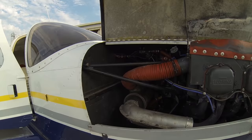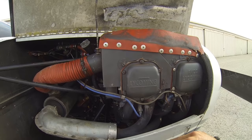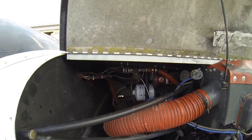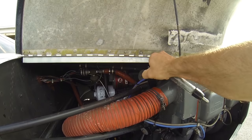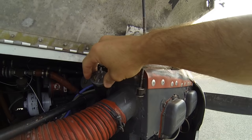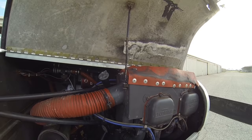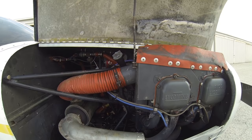As we work our way up to our nose here, we're going to look inside our engine compartment — make sure all our wires are intact, nothing's frayed or broken, everything looks right. No obvious signs of oil leaking or dripping, nothing that looks awry, no obvious signs of cracks or wires hanging loose. We'll also want to check our oil level. We'll wipe it off with a paper towel and put it back in — we can see we've got right about six quarts of oil. Six quarts is great in this airplane. Make sure you check your POH to see what level your airplane needs to be at; oftentimes airplanes don't like to be filled all the way full and will spit extra oil out through the overflow tube.